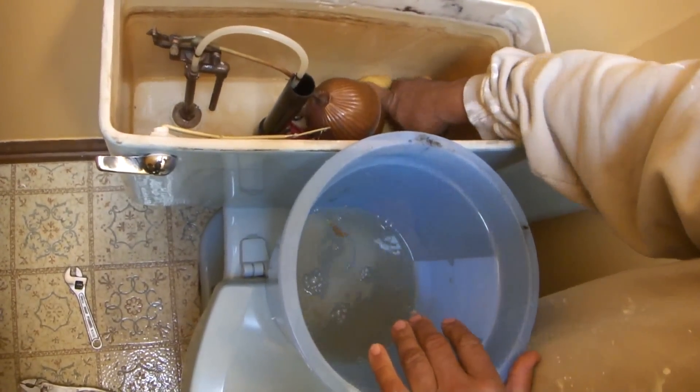I'm going to buy new bolts like I always do. Now look — you pop these two things off, there are two washers. Right now the toilet isn't loose. Let me show you how you can just pick it up — right like that, it's halfway out. On this side there's a cap that's covering the bolt; I'm just going to hit that off. I'm going to show you how this side can come off with a plier. Actually, a plier is very fast. Now I'm going to take these two off again — just pop those off and loosen them up a little bit.